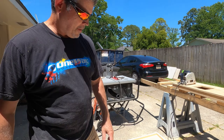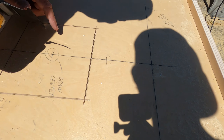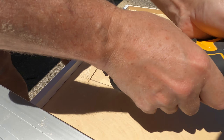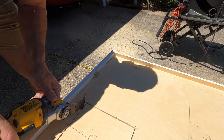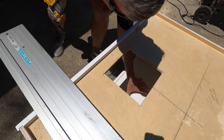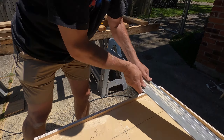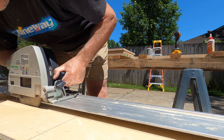There's the center of our drain — we just went four inches each direction, so now let's cut that out. We cut this with our track saw acting like a bridge — we're going to call it a bridge saw now, patent pending — but it didn't go quite all the way through. I'm going to finish off these two cuts with the jigsaw using a new blade.